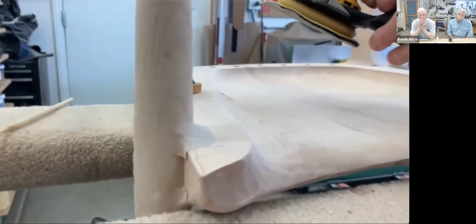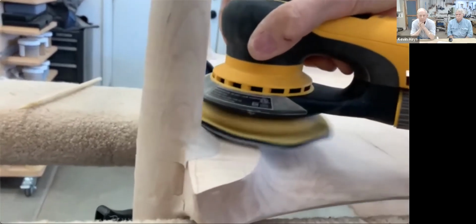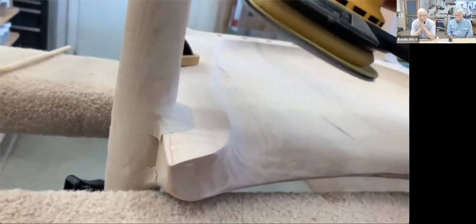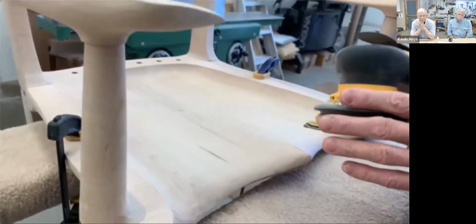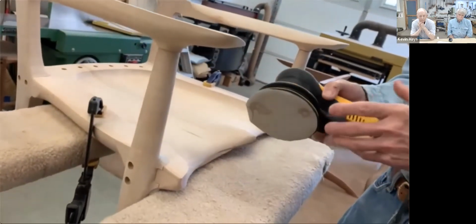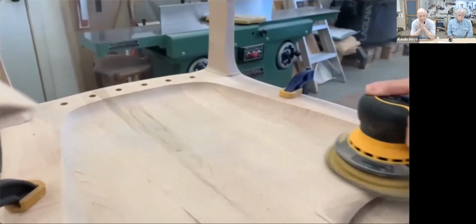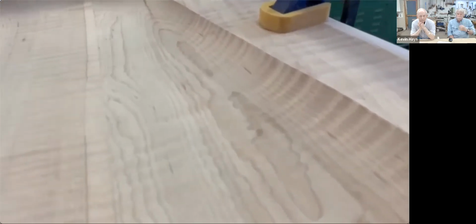And again, if I turn the sander on, I can turn this sander way down, and I can just very gently get into where I want to work, as opposed to having it on really high speed, which is scary in a delicate area. So the combination of the variable speed sander with the high RPM and the ability to put different pads on them make this a real diversified tool to use in a lot of aspects. As an example, right here, I can just sand right up inside this coved area with this contour pad.